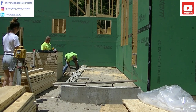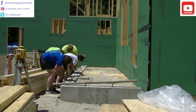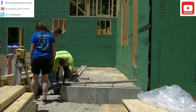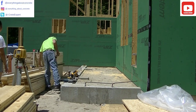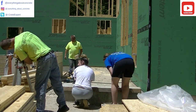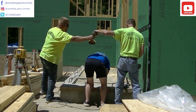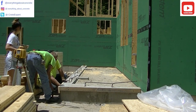That DeWalt battery drill — we'll screw that right on, then it'll take it right back off again nice and easy. Top of the 2x4 right flush with the top of the concrete wall, all the way around the outside. That Bosch hammer drill works really good. I'll have a link in the description if you guys want to check that out. We use that thing all the time for lagging forms on like this, and those Tapcon screws work really well too. I'd highly recommend using those.